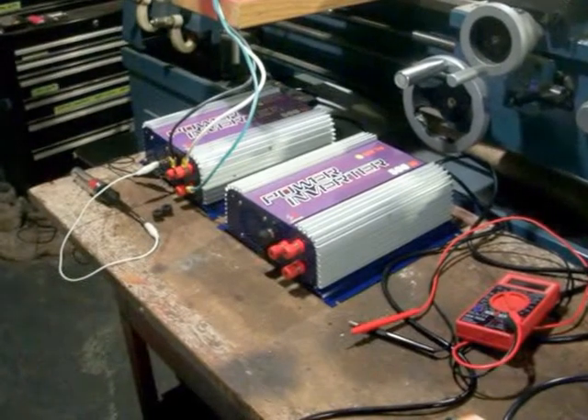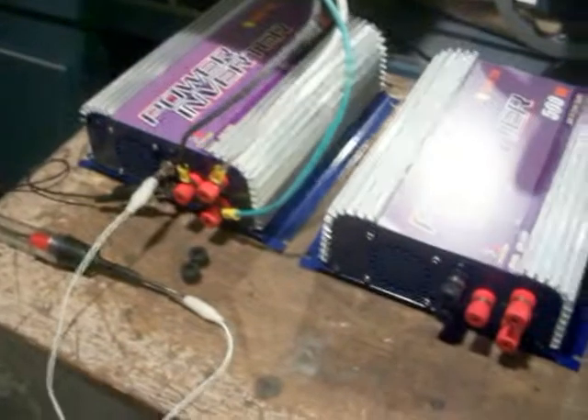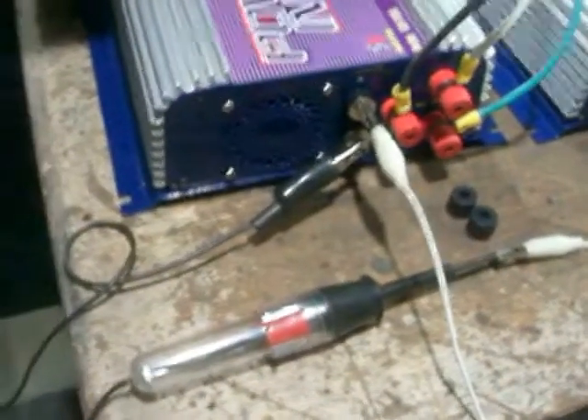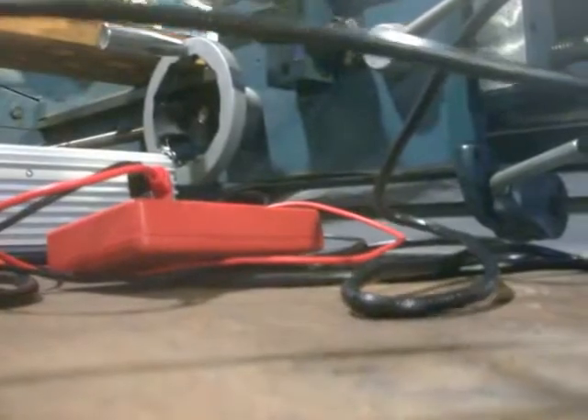This is the next morning and it's been bugging me why I'm getting 30 watts now as opposed to only 11 in part 1 with relatively the same RPMs. Sometimes when I turn this on the dump load is engaged and sometimes it's not, but when I run the PMG it comes on. Let's see what happens when I just plug this thing in — okay, the dump load is on.